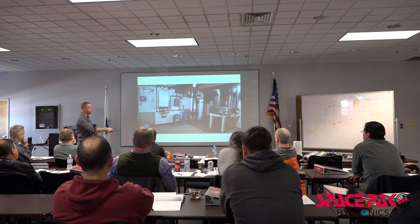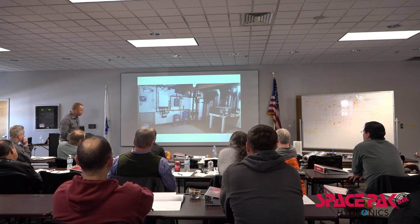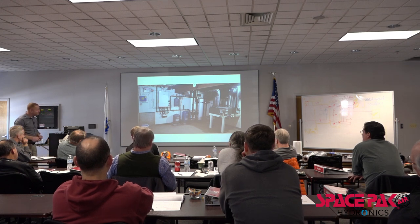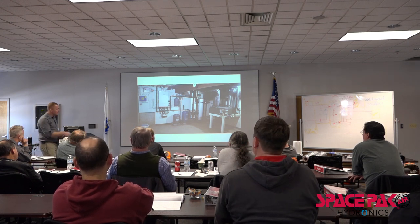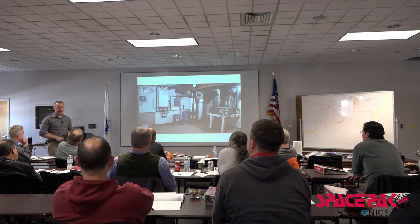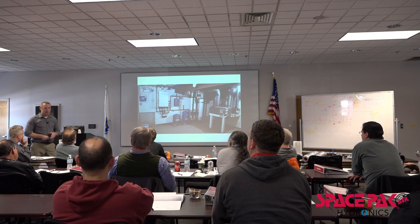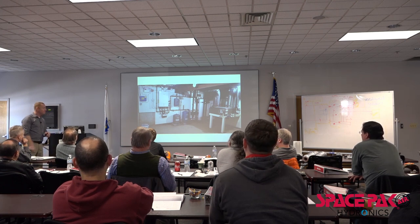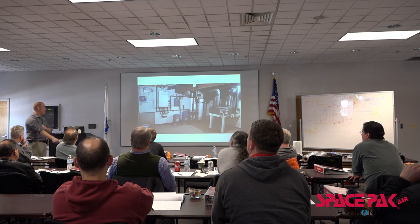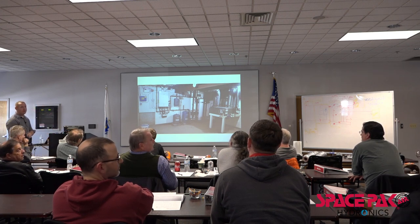See that nice installation of the drain there? Heat trap? You had somebody do that for you? I did. Yeah. I got my chops busted because I painted the legs on the stand, but I didn't use pressure treated 4x4s. The building inspector, that's what he picked me apart on. Anytime you touch concrete, you're supposed to use treated lumber. Yeah, that's the code they changed.